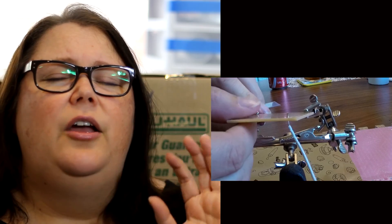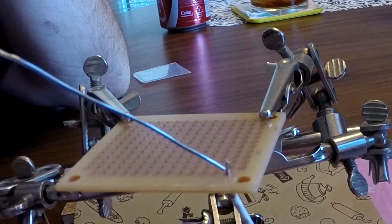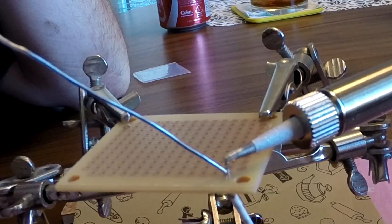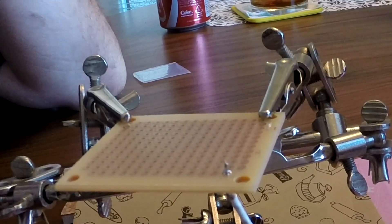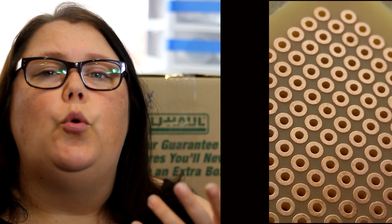You're just going to thread the wire through the board. Just like before when we tinned the wire, attach the soldering iron to one side, the solder to the other, and you just want drops of the solder to pool around on the board. The trick is that you want to make sure you get the right amount of solder on the little contact at the bottom — that's called the copper pad.